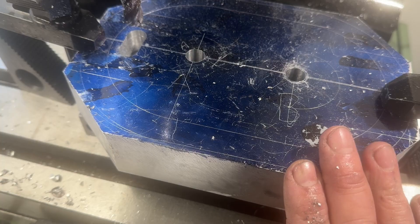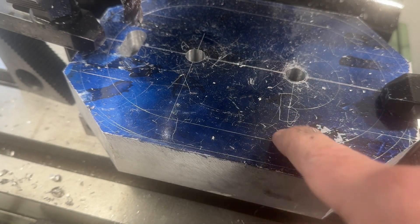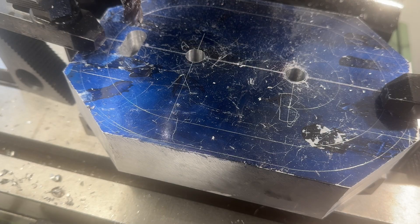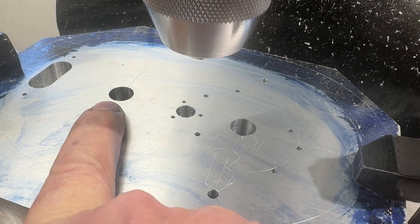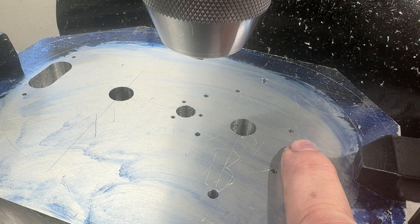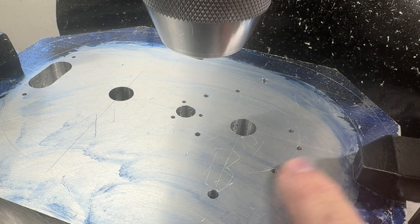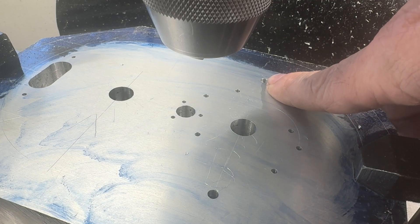Okay, this thick billet of aluminium is going to be for the engine mount. I have drilled and reamed two holes — the A and B holes. I have drilled two holes to hold on to the ignition brush assembly and put a slot in as well. So now we have all the holes on this side drilled — that's the A hole, that's the B hole, that's going to be for the oil pump, and these six holes around here would be for the points if I use points.